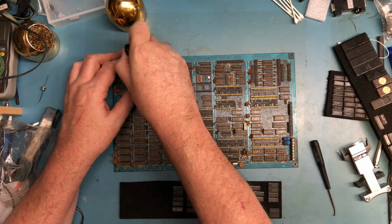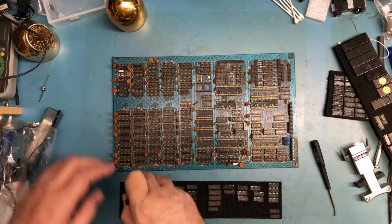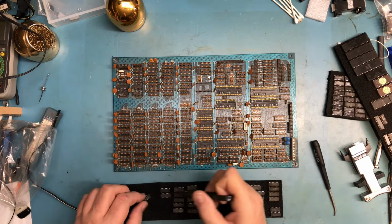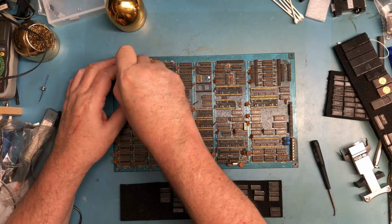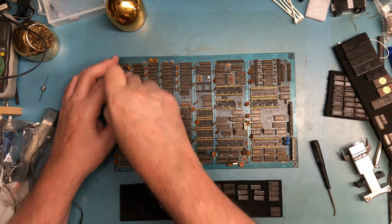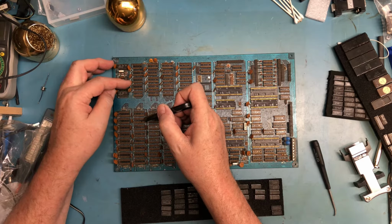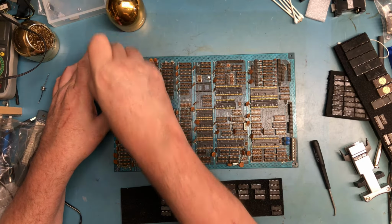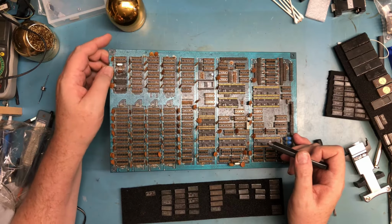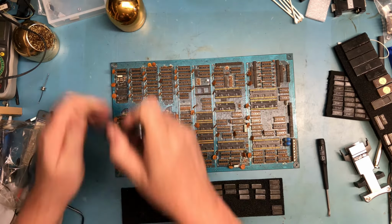Looks to me like a pretty straightforward design. Don't see anything about it that seems odd for the era. I'm still impressed they're using these high quality sockets. I think I've said this in a previous video on the board, I've read that Ferguson shipped the kits with the high quality sockets. I just didn't realize that meant gold pins, but I'm guessing now it does. That's really weird. There's a U47 printed directly on that chip. Oh, that position's U12. I wonder what it stood for, 24th week of 80.